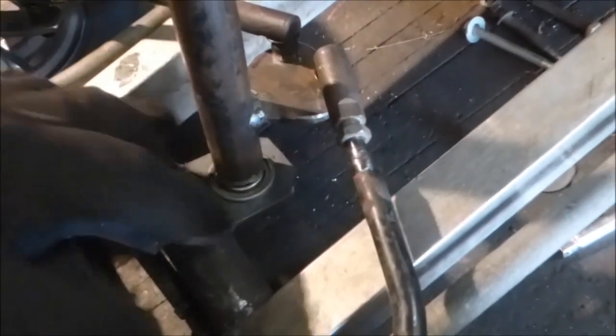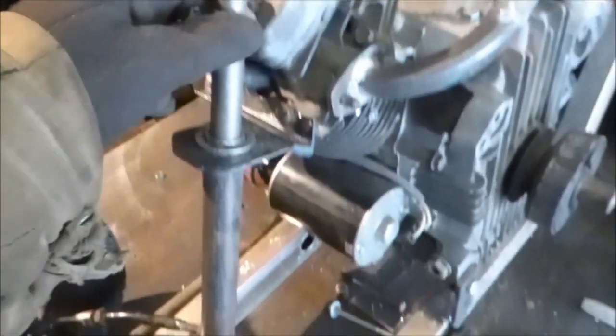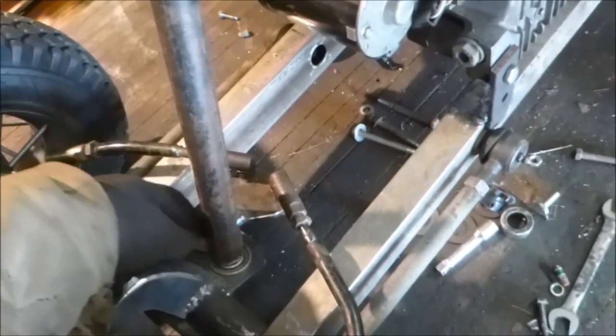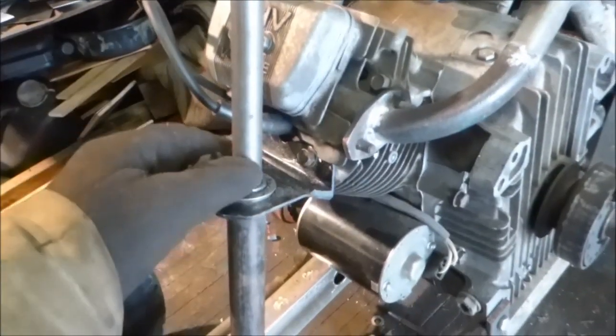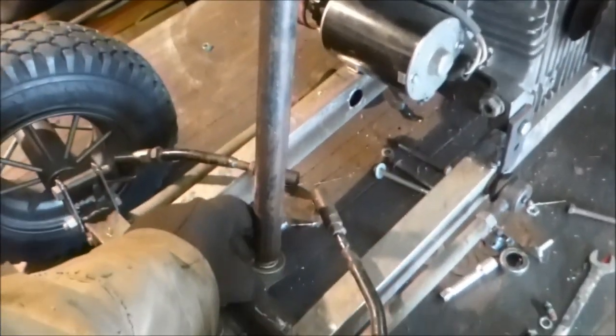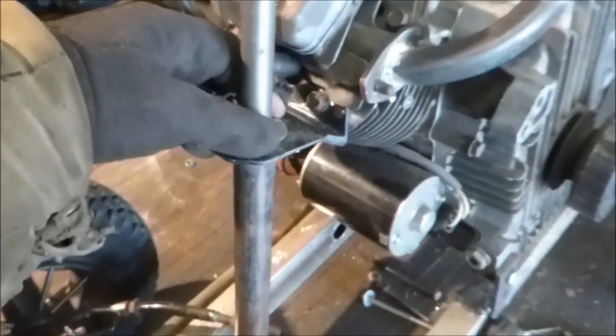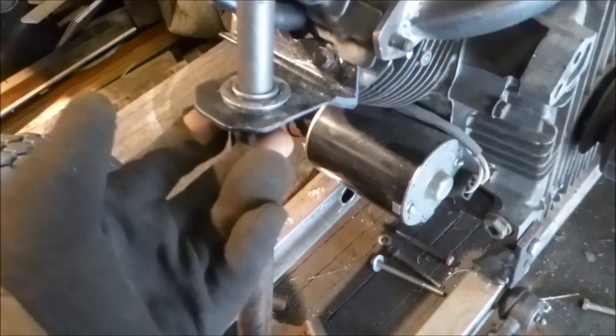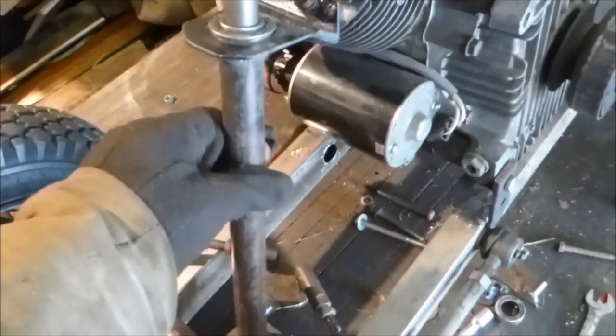Running back to the steering shaft — I didn't have a full length of 3¼ inch shaft, so I welded in this bigger section here, and 3¼ on the ends. That way it's captured in between the bearings here. This is the wrong way around — on final assembly I'll put this on the bottom so that this can't go up or down. That'll hold that in.